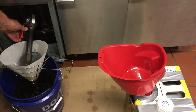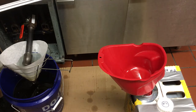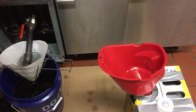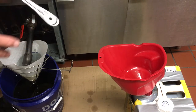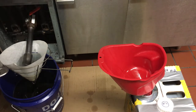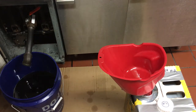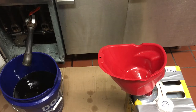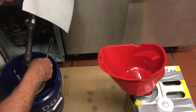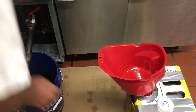We're all done now with fryer two. I like to use one of these spoons to get debris out when rinsing — hold it upside down and use it in the trough inside the bottom. But I don't like to do that when we're filtering oil because it'll just make the oil dirtier. Let's throw our lever off, get our filter over into the trash, dump that filter, and start with a new filter for fryer number one.